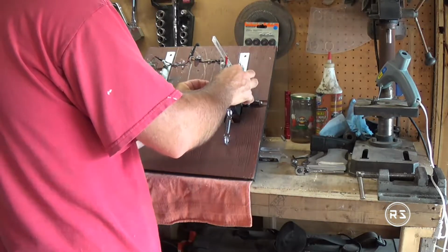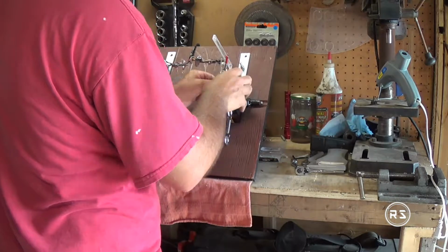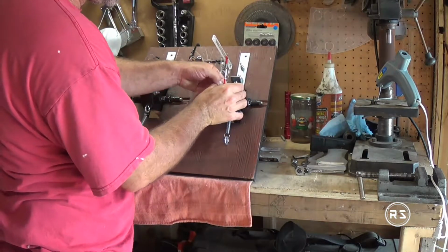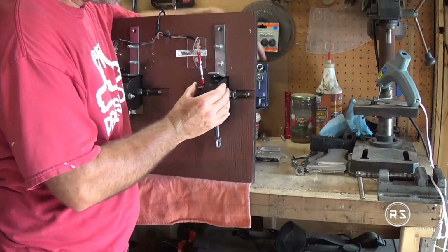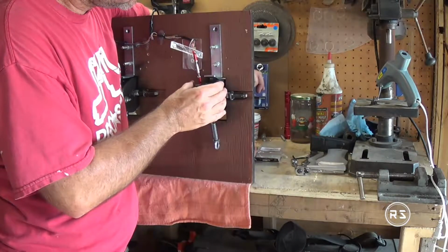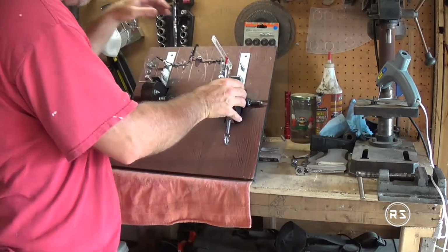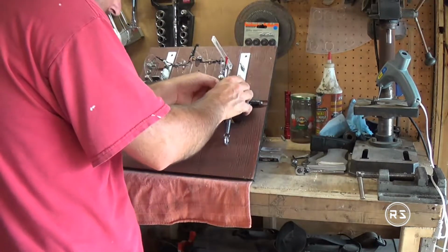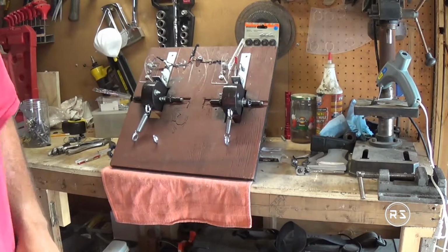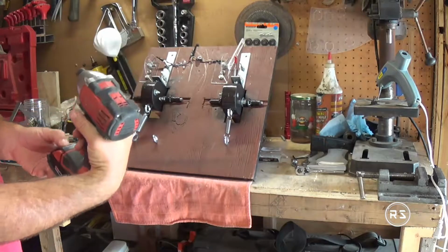Now that I've found my center point for the arm of the potentiometer, I am looking for the right spot to screw the linkage to the pedal. If you screw it too low on the pedal, the potentiometer won't travel its full course, and you will be at full throttle, but the game will apply only 3/4 and not full throttle.